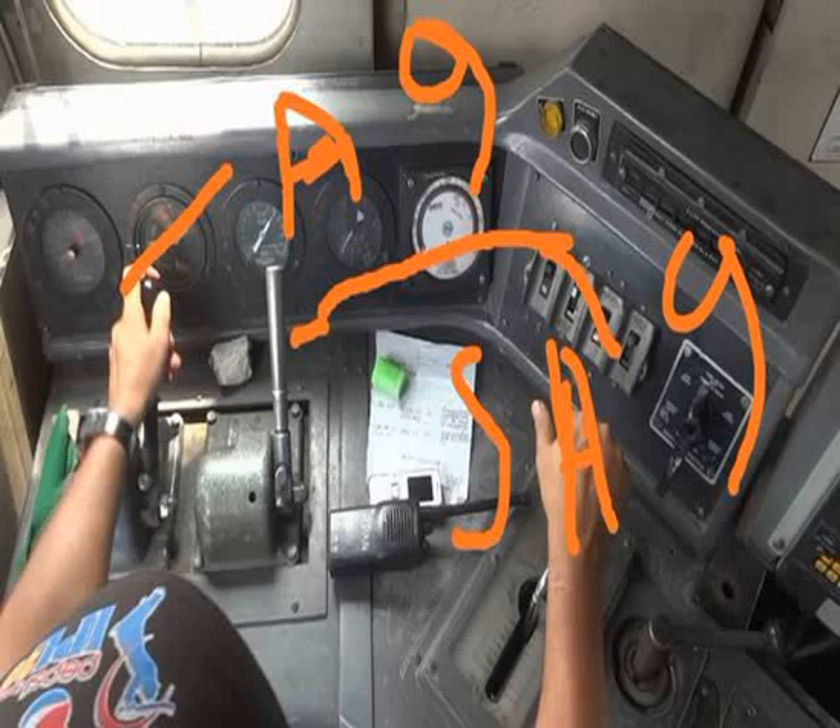Passenger vehicles must have easily visible and reachable emergency brake handles. On S-Bahn vehicles it is allowed that the emergency brake can be reset and is allowed to only result in a display when used outside of platforms. The implementation of the S-Bahn's emergency brake does not currently reflect the state of the art in Germany. It failed in practical use at least once — in 2015, a driver lost consciousness but still accidentally triggered the vigilance device. Unlike the system BU 2004 used in conventional trains, the brake was not activated because it is only an indicator light and a sound. While the train was running on the track without ATP enabled or overspeed, the passengers noticed the unconscious driver but could not stop the train by pulling the emergency brake handle.